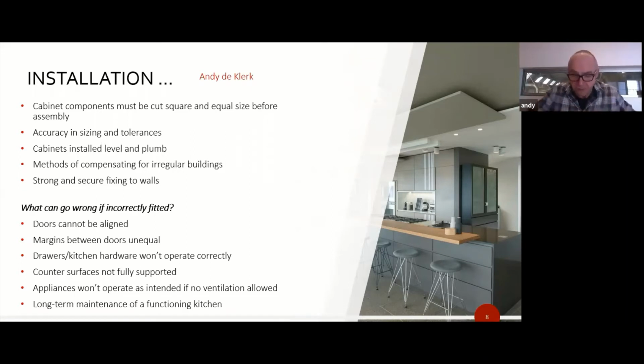So once you've got a level plinth down, you put these square cases on, and generally they are screwed together. Sometimes they're just screwed anywhere, and then there's little white stickers that go on. What we like to do is take the hinge plates off. You unscrew one and you put a secret screw in behind the hinge, or you take a drawer runner off and you screw behind the drawer runner, so that when you open the door or the drawer, you don't see any visible fixings.